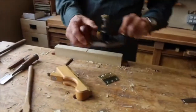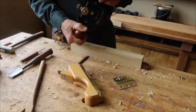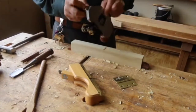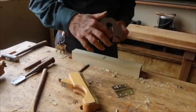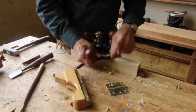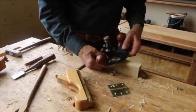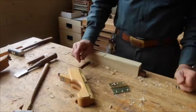This is the other version — Stanley made two versions, but this is Veritas' version. This has the full sole plate all the way around, but kind of the same issue. You've got very little sole plate there, which can drop into the gain as you're making it. So those are two issues I have with using the router plane.